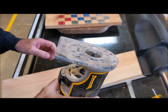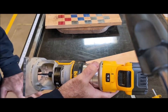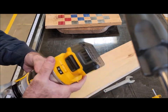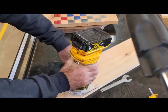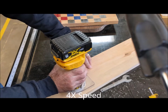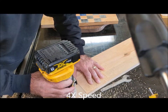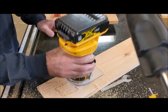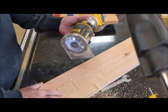We'll try out a few different bits. That's a ball end mill right there — two flute. Got the speed setting at about four. This is some pine. We'll go ahead and turn it on. Really nice round over with this bit. Nice quick shutdown. You can see it cuts nice — no trouble at all.